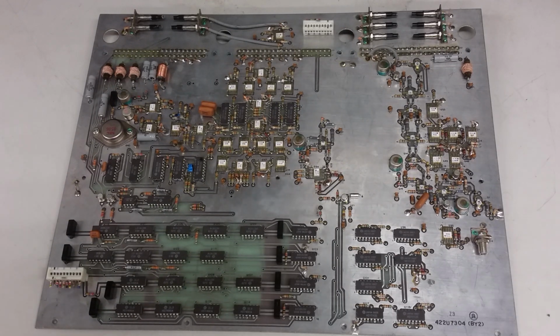It's actually the designers at Motorola and Fairchild, especially Fairchild, I think, put a lot of thought into how to make chips that are good to use, or easy to use. You follow their rules and everything works out fine. Yes, you're dealing with nanosecond propagation delays back in the late 70s, which TTL couldn't even come close to. And you have to deal with all sorts of things you don't need to worry about, like the length of wires and things like that. But if you followed the manufacturer's rules, and they had a book for that, it was actually a pretty good family to work in.